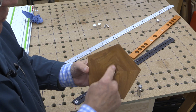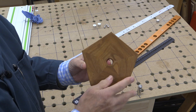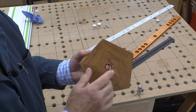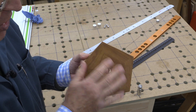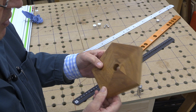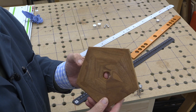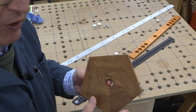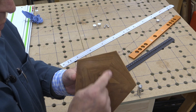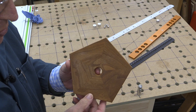With this pentagon there are five interfaces between pieces — in other words, there are ten cut faces that have to come together accurately. So in making this, any slight error in the system would be magnified by ten times. I've produced what is quite a reasonable piece here, but I really needed to demonstrate it in a little bit more of a stressful situation.